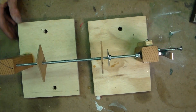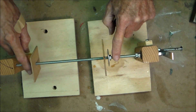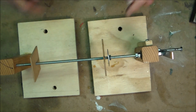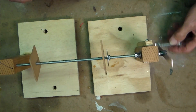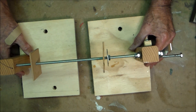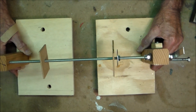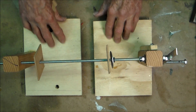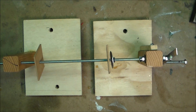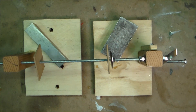Take your coil form and clamp it securely between the pressure plates by tightening the two nuts on the outside. Once your coil form is secure and centered, you are ready to start winding. This jig is adjustable for different lengths of coil simply by sliding the verticals apart or pushing them together. You could bolt or clamp your verticals to your workbench, or secure them with just two heavy weights — that way it's easy to set up the jig anywhere in the shop.